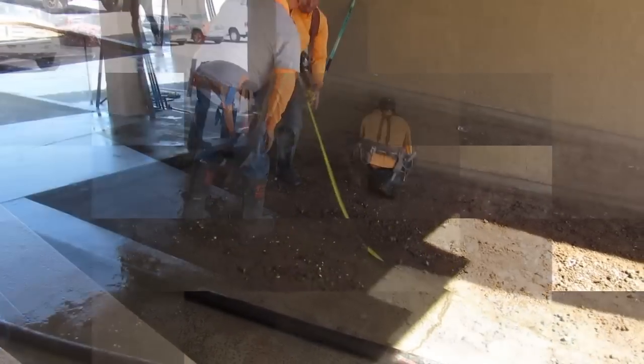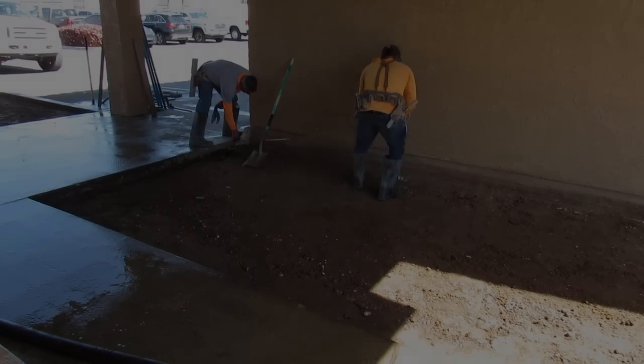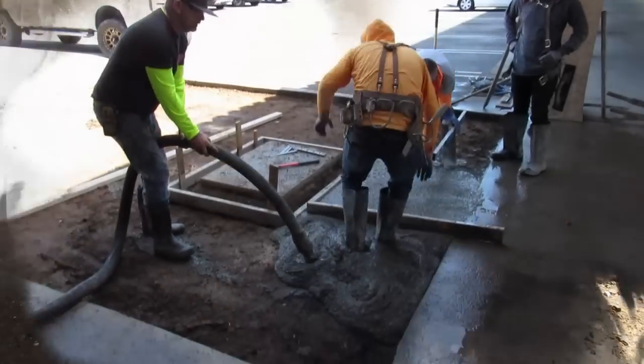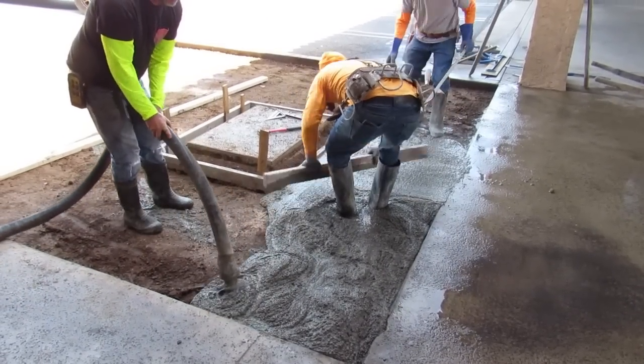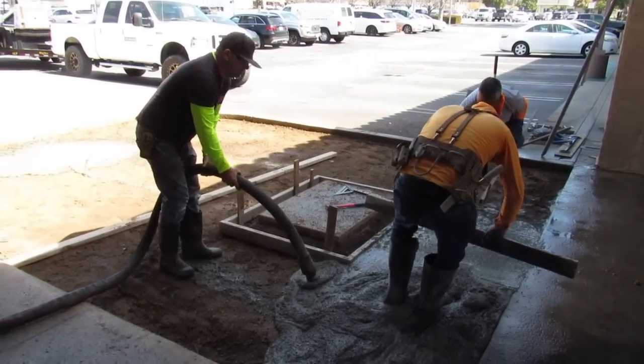So we're pre-marking the joints. We always mark them, measure it out prior. You could do it after. There's plenty of time. I got 2% in this, but this part's under an awning. This part's outside. So the other side's never going to see water. It's underneath. This side's critical, though, to get the water out, especially with people sitting out there.